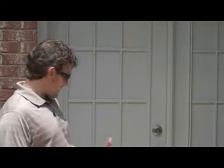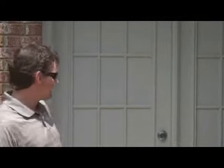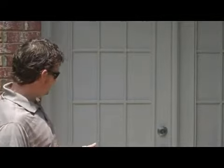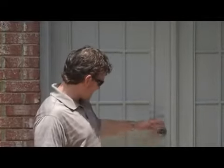It basically comes in a gallon bucket like paint, and we brush it on all the glass, and it acts as a primer as well. It's actually a masking liquid compound that we brush on the window panes. And then once we get the doors done, which we spray, it minimizes all the brush strokes and the flashing of the paint. Once we get all these covered and taken off, as you can see, there's no paint on any of Matt's hardware and stuff like that.